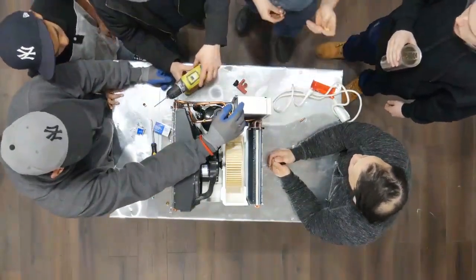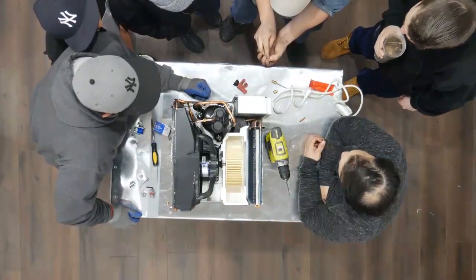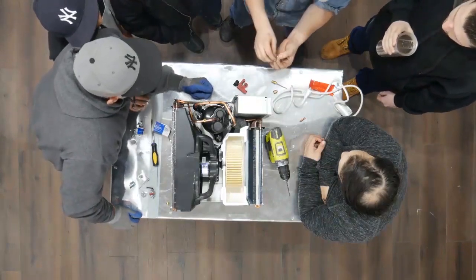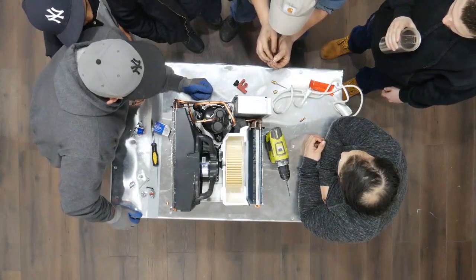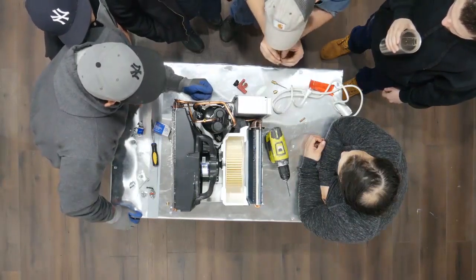I'm going to take the pin out. You guys ever seen a Schrader pin? You guys know how a Schrader pin works? There's a very small rubber gasket right there, and it burns out — that's why we can't torch with it. But when you depress this, air actually goes through those little cracks and then out from in there.